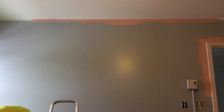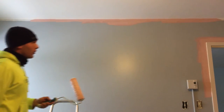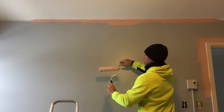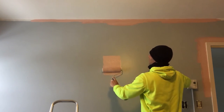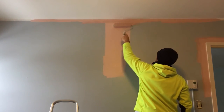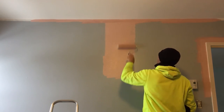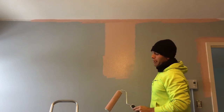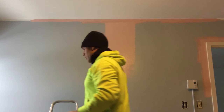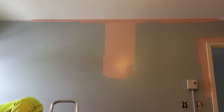So you take your roller, soak it up good — just roll it in the paint tray. Right now it's green, I'm using pink paint, not my choice. Make sure you soak it in good. Usually the first time you go with a brand new roller, it doesn't soak in that much — you've got to get a couple runs with it. Then what I like to do is work from the middle, because wherever you start you have your wettest spot, so you're basically spreading the paint out from that. Work your way out from the middle, and I've always liked to do the high spots first and then work down — paint rolls downhill, so whatever drips and wet spots you get, it's easier to start high.